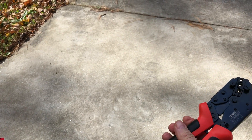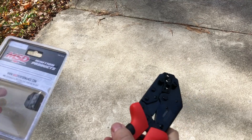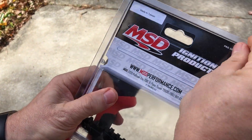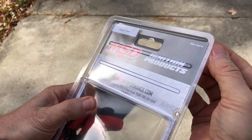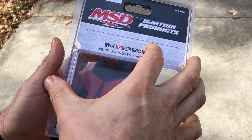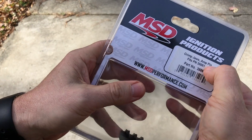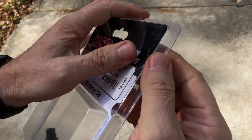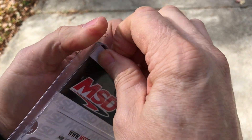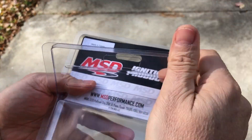Now what I'm actually going to use it for is what's called a Series 56-type connector by Packard Electric, and later Delphi, and then later Aptiv. I'll put some info on here when I get the editing done. And I'm actually going to use this die, which is for the AMP pin type, number 3506. This one works really well for those types of connectors - it's actually what I'm going to demo this tool with here.